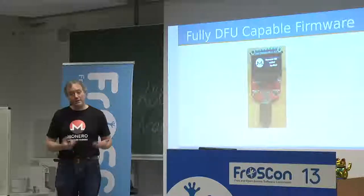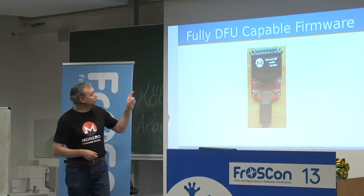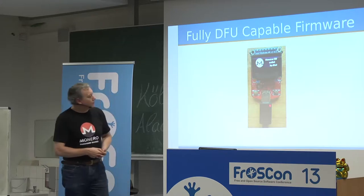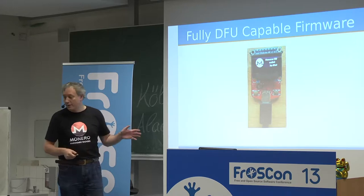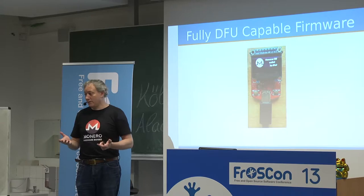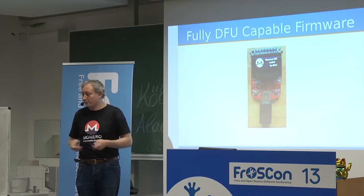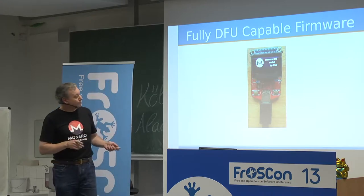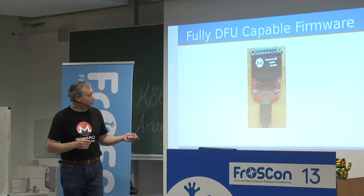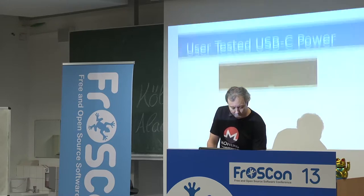It's called Device Firmware Update, which is DFU. Even if there's nothing to update, in the first case, as soon as you put a program on there for the first time, you can use DFU if you have your project set up to do that, in which case all you need is a USB cable. So no more JTAG anymore. We're sending boards out to testers, and all they need to do to try different firmwares is to program them over a USB cable. It's a makefile, really, that does all the work. So they download the firmware in order to compile it. They type make, as is commonplace in free and open source projects, and then in order to flash or program that firmware over to the device, they type make, I think it's flash or something like that. And they have to have the USB cable plugged in, and most of the time it's rather automatic. There might be a couple of udev rules to add or something like that, but it works very straightforwardly.